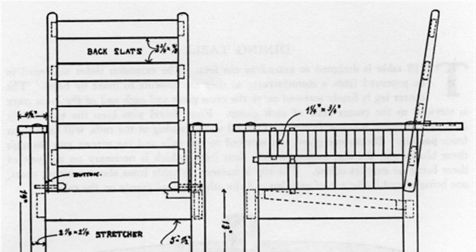Step 6: Attach inside supports. Place the 2x4 inside supports 3/4 inch down from the top of the side and center rails. Screw into place. Step 7: Attach the plywood seat. It will fit snugly between the sides and center on top of the inside rails. Make sure it is flush with the top of the rails. Attach.